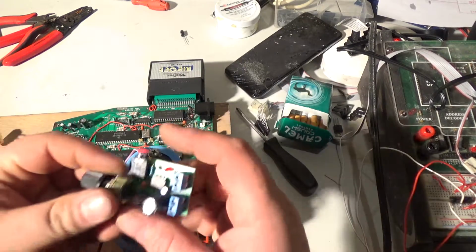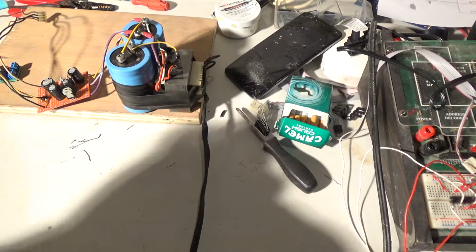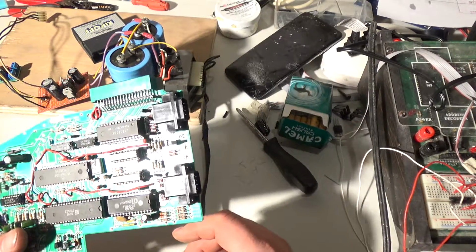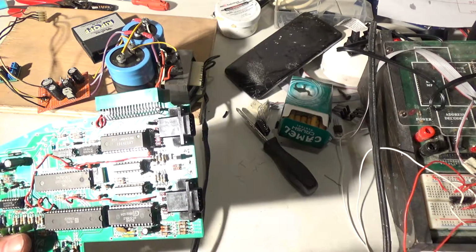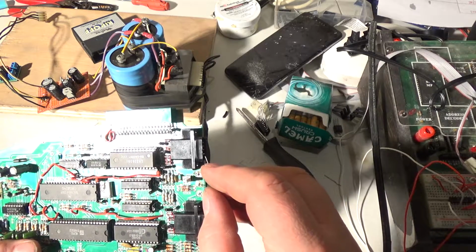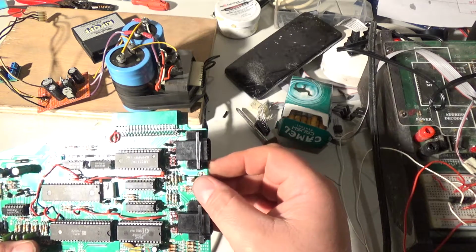Anyway, right now I'm going to put this together and get this amp hooked up. Now, I have not looked into how they do the buzz-off mod, or whatever they call it, buzz-off kit. But what I noticed, and I'm not looking at the schematics either, is this originally had a 10 kilo ohm potentiometer across here for volume. So I got a 10 kilo ohm resistor. Now, I may not even need this, but just because, I'm going to put it across right here as if there's a potentiometer.